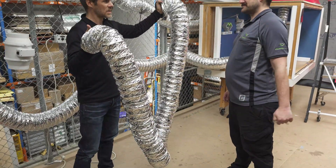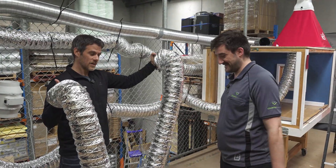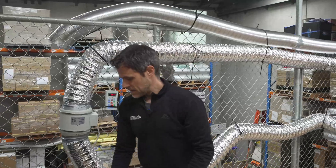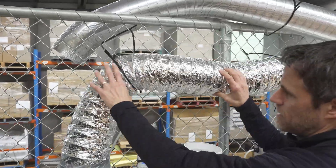People do that for sound because it makes it quieter. One reason it makes it quieter is because you're just not getting much airflow anymore. This is an example of something you'd see where you wouldn't have the support there — you'd have a pinch right at the inlet. That's pretty typical.